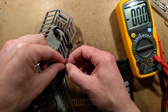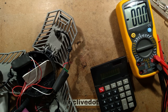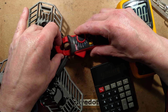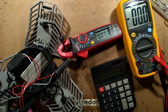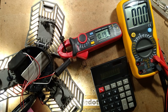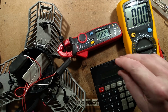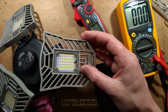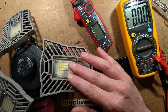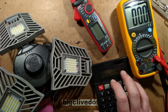I could also try clamping that with a clamp meter to see the current going through it. I shall set it to 2 amps DC, null it out, and plug it in. It's showing about 200 milliamps — fairly accurate, 200 milliamps. So that's 100 milliamps through each of those LEDs. Which given their size is quite a lot, but they're almost like 2835-type LEDs — not that big. At 100 milliamps that's about 0.3 watts per LED, which I think is fairly typical for that size.